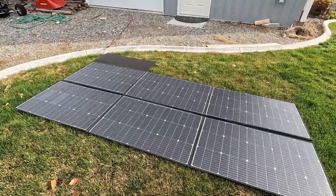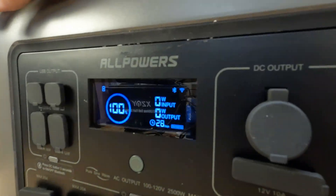So let's talk about the AllPowers S2500. First, this power station has a 2,016-watt-hour battery. On the expansion ports, when I tested them fully charged, I only got 50 volts. On the other hand, it has 1,000 watts of solar input, so you could actually take a large golf cart battery or something similar, plug it into the solar port, and extend runtime quite a long time. There are also their own expansion batteries you can buy. It's important to understand that the internal battery is not your typical 51.2-volt LiFePO4. It has a 2,500-watt max inverter, which is presumably where the S2500 name comes from.